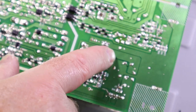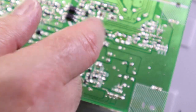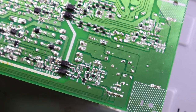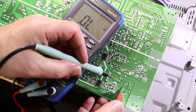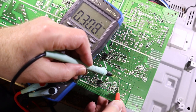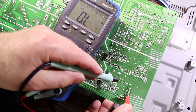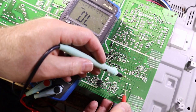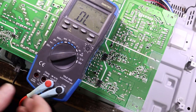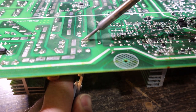We could also check the output side. There's a two-pin diode rectifier and our main output capacitor. The output rectifier diode reads 0.4V and the output capacitor shows plenty of resistance — not shorted. I think we just replace the fuse and see what happens.